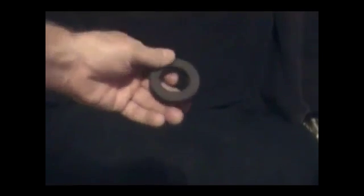This is an example of a ferrite toroid and what it looks like. This is really too small to be workable because they're really hard to wind when they're this small. I really recommend getting something larger like this — about 7 inches in diameter. This is much easier to work with and you get much more power and just a lot more workability to it.